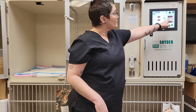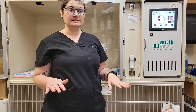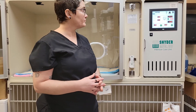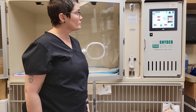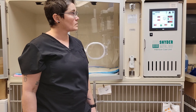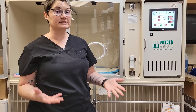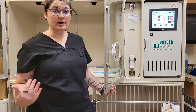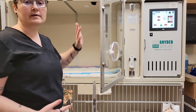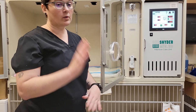Temperature, you want it to be around room temperature. The oxygen — if it is going up and down or just down — wait until it stabilizes and is not fluctuating anymore. This is still going down a little bit, so we're just going to wait for it to continue going down until it has stopped before we actually do the calibration. During this whole process, we're keeping those compartment doors open so it can air out and equalize, which helps it to stop going up and down.